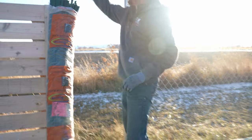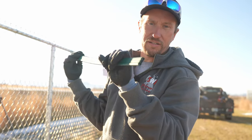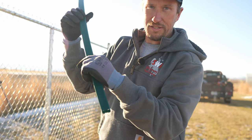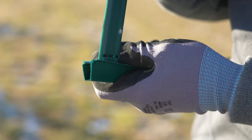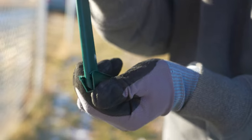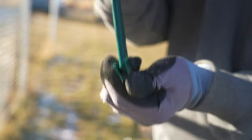We're going to take one slat out. One end is cut flat, the other end is angled and has a notch in it. It doesn't matter which way this goes or if it faces the inside or the outside, because there's a rib on each side of that channel. But the notch does need to go down because it locks into the bottom lock — and once you put it in you can't pull it back out.